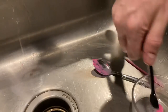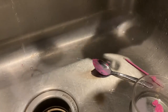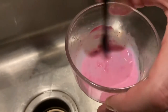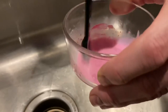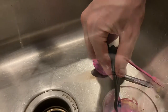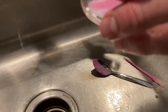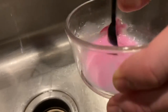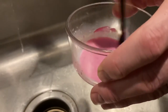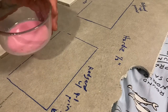If you're working with HardieBacker, there have been a lot of comments saying you should prime it first, and the instructions do call for a primer. The instructions say mix it at four parts water to one part RedGard, so that's what I'm doing here. In our test we're going to apply the primer to one group — I'll do a separate video to see if it actually affects the strength and bond.